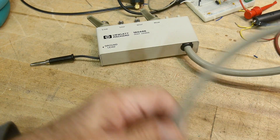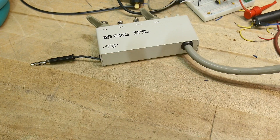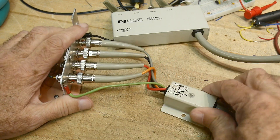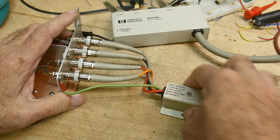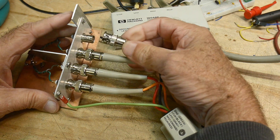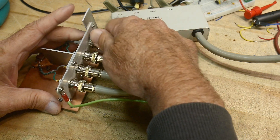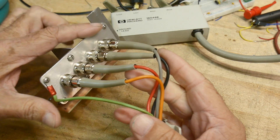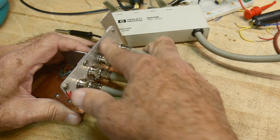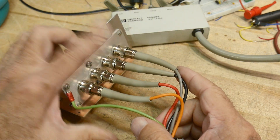This is the 4 meters of cable. On the other end, you get this little terminal block that you can screw down so it doesn't go anywhere. You get four BNCs of excellent quality — these even have the HP part number on them. It comes with a little header block. The grounds are completely isolated until they hit this piece of aluminum, and that piece of aluminum sets a reference plane for all measurements. That's what you buy for $1,344.